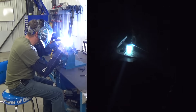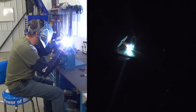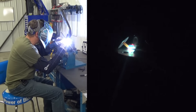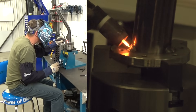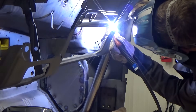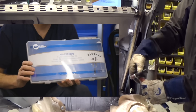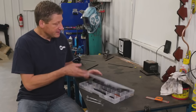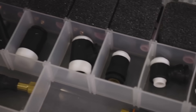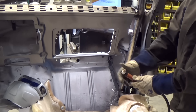We talked about this high-strength Docol tubing before — I basically treat it like chrome moly and use 1/16th ER80S-D2 filler metal. I have my Multimatic set for DC TIG steel at 180 amps, regulating with the foot control. Welding the connector bar to the A-pillar bar is another area where the torch upgrade I did back in Season 2, Episode 1 will be useful. During that Real Gear segment, I upgraded the TIG torch with the AK-150 MFC kit, which allows you to change torch head configurations quickly and easily. I'll be changing to the small number 24 flush back head to get into the tight areas.